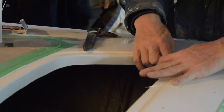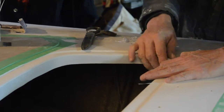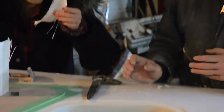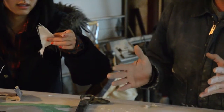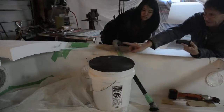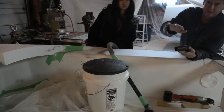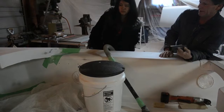And then you can control it, and you have a nice pretty little tape wrap of baseball if you use the right material. So what's this made out of? They call this e-glass, just regular fiberglass cloth. In this particular stuff, this might be 6 ounce, and this is sanded, finished down to the glass. Then my blend, I'm not losing any material. Right. And it's simple to fair.